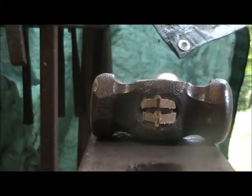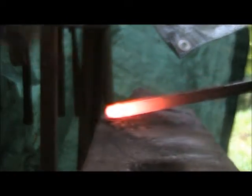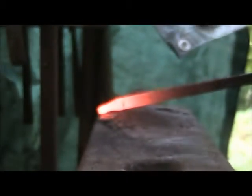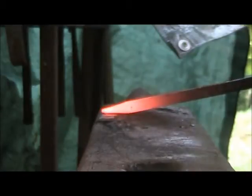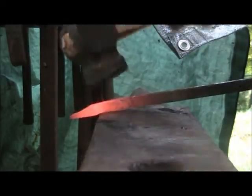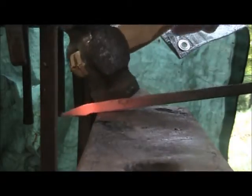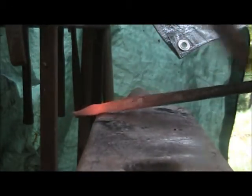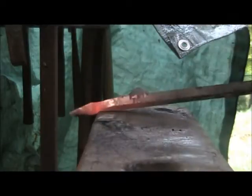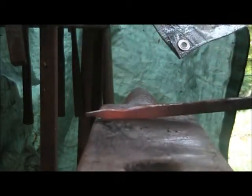I'm going to be putting a broom on the end of it, and I'm going to tie the broom myself. Here we're starting with the taper, just on the end of a 3/8ths square bar. This bar here is 22 inches long, and I'm just drawing it out to whatever diameter I find fit — I believe about an eighth of an inch at the end.